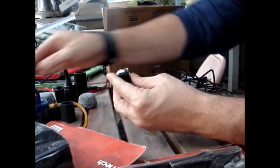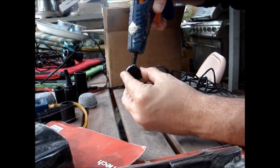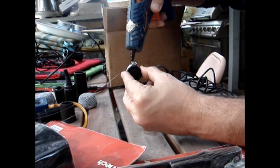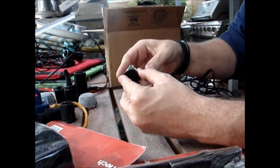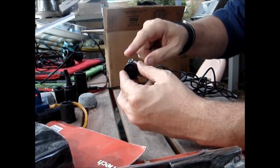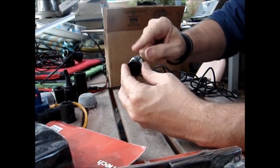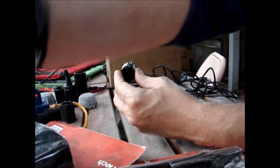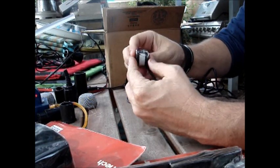This is where a little can of air duster comes in real handy. Flip it upside down, give it a little blast, and your hot glue is set. You don't have to sit there and wait for it to dry or put your finger in hot glue. Then I go back over the fragile solder connections and put a little blob on there. Wet your finger and tap it down a little bit to make a nice smooth, even shield over the fragile part. Give it another little blast — now that's nice and protected.